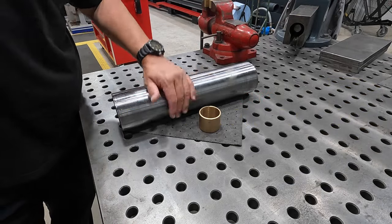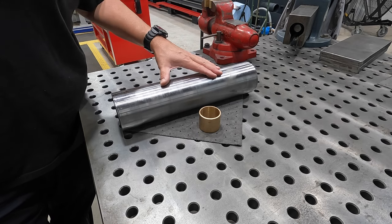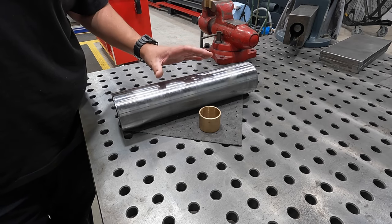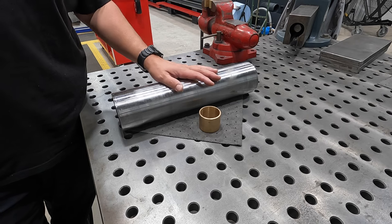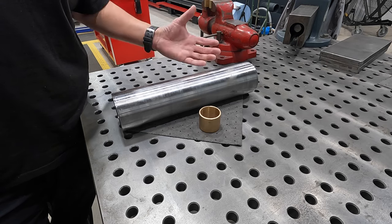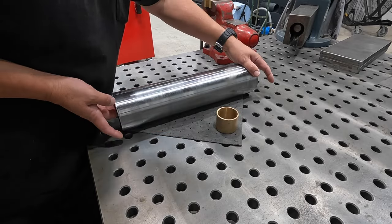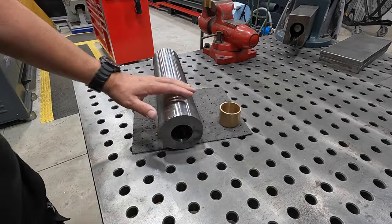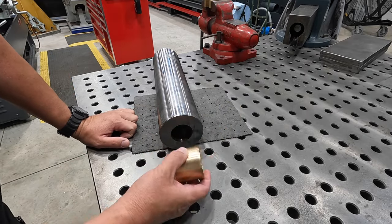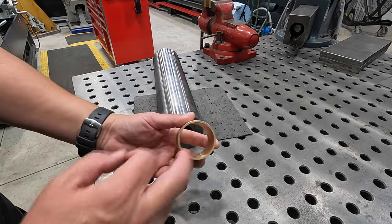We've got a job here - we're going to the pacemaker to get it done. I'm helping out the welding shop. We have a piece of two inch by four inch heavy wall mechanical tubing that's going to be a pin boss. This is a typical job they handle at the welding shop quite often, most likely for one of the garbage trucks. We need to counter bore the ends for a bronze bushing to press in, and bore it all the way through so there's adequate clearance for the pin.